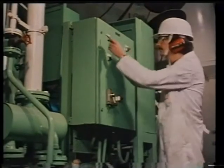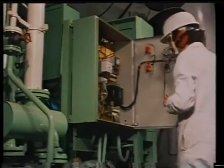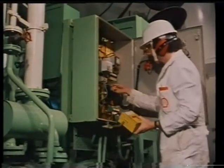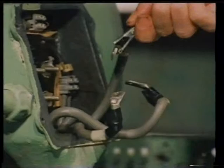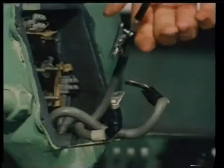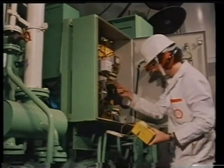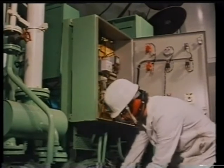then the test is made. You will notice that here the starter is near the motor and the ends of each feeder cable are within easy reach. If this was not the case, then first the cables would have to be tested for insulation resistance between phases to eliminate the possibility of a short circuit fault. Then one end of all 3 cables connected together would allow the testing of all 3 cables for continuity at the other ends.